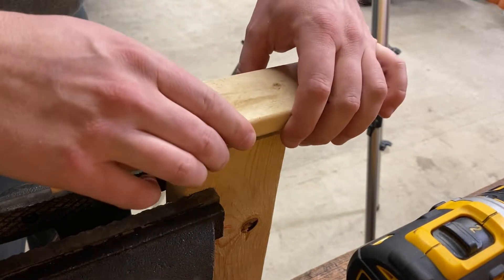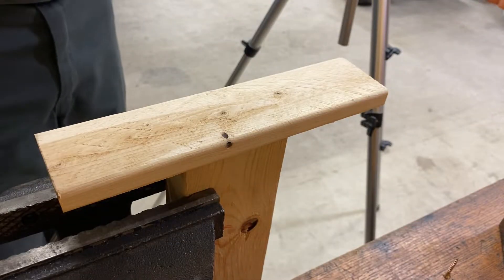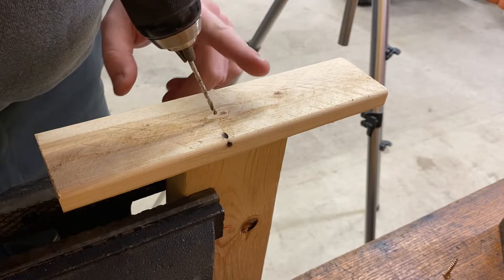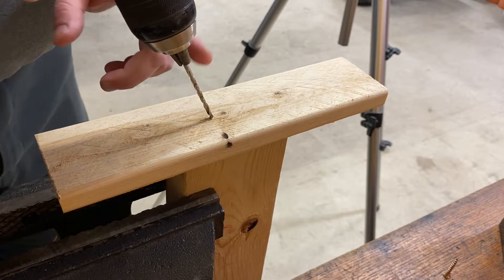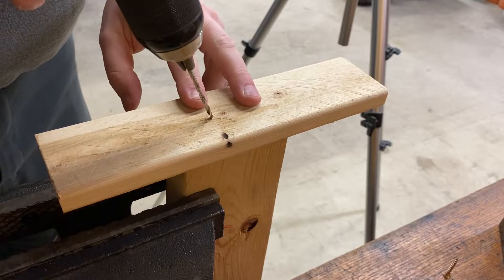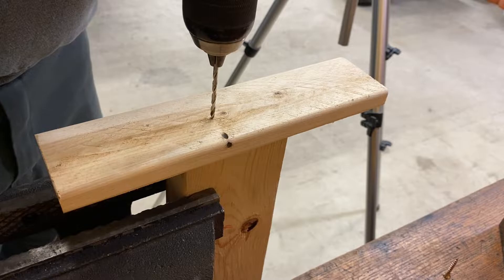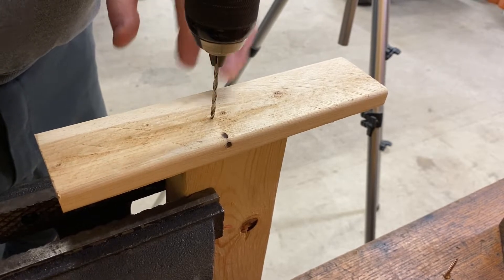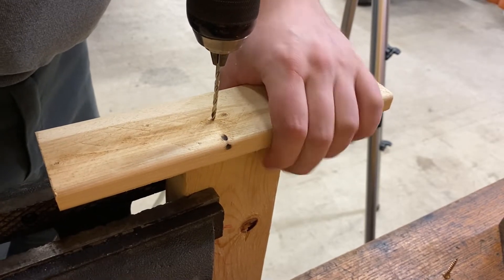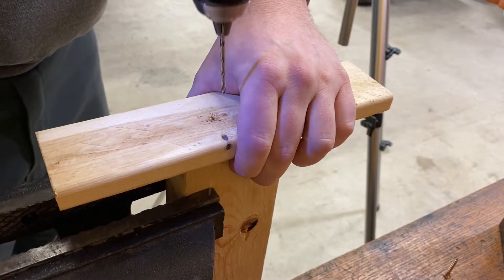When we go ahead and put our piece of wood on, we're going to set up however we want our joint. The first thing we're going to do is drill a hole straight down. Oftentimes what I see students doing is they're looking and going, okay, I'm drilling a hole here — and you'll notice that the drill is really pointed at an angle. If I drill this hole down, it's going to shoot out the side of the board. So you have to learn, and if you need a partner, have your partner spot you to keep it straight up and down — not tilted side to side, not tilted front to back. I'm going to go ahead and drill a hole through this piece and down into my next one. Make sure you remove the chips on occasion.